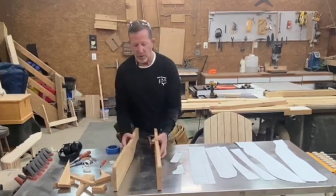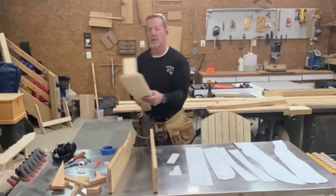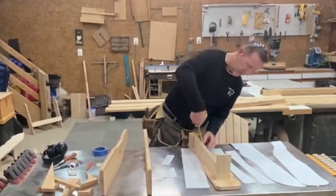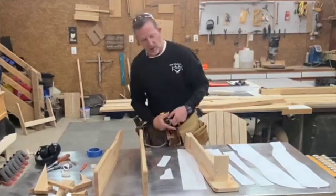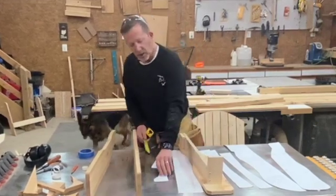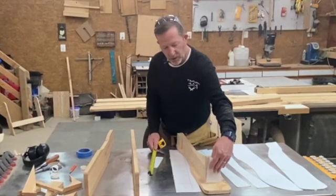What I'm going to do with the arms is make the bottom pieces, and this is just a piece of about 3 inch, I think a little over 3 inch. Yeah, 3 1/4 inches tall. So I'll rip a couple pieces there and glue these on, and then I'll shape the corbels to the proper shape as well.